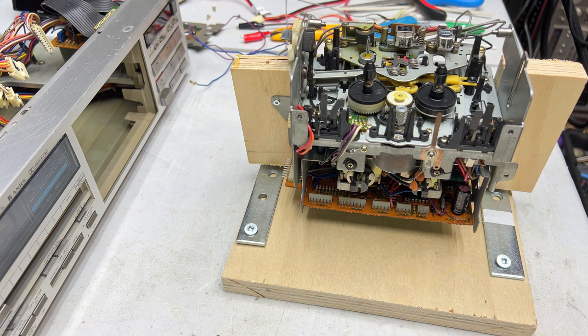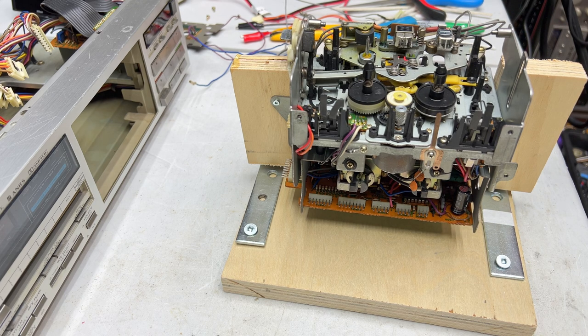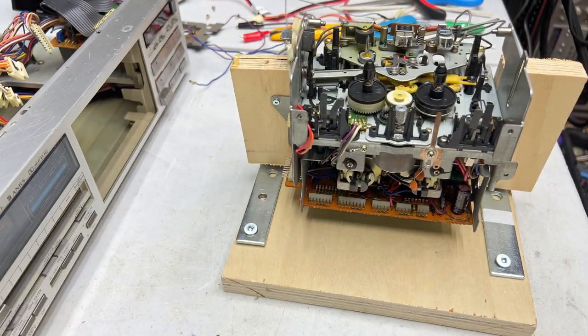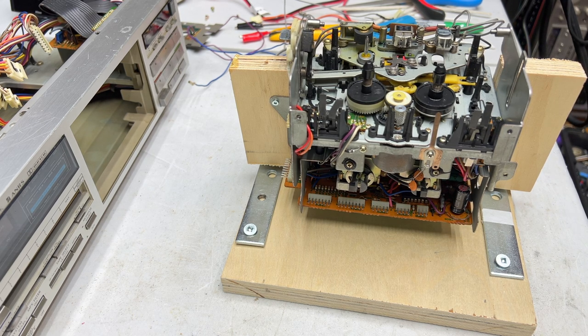You'll probably remember me saying in the TDV 931 video that there are felt clutches inside some of the reel tables of JVC units, and this one is no exception. Well, and I apologize I didn't do this in the TDV 931 video, but I finally woke up and realized that I hadn't run this thing in the TDV 931 yet, and I discovered it's got more problems. Namely, both the back tension torque and the take-up torque are improper in that deck, so we're going to have to get in there and look for that issue as well, aside from the head alignment issues.